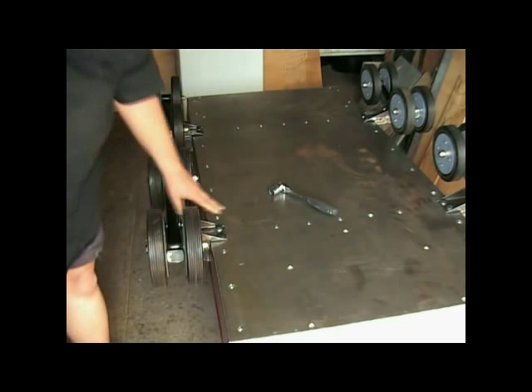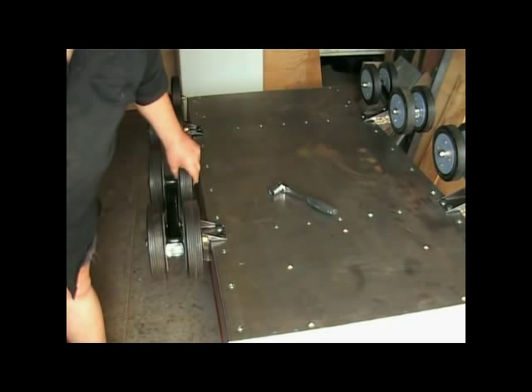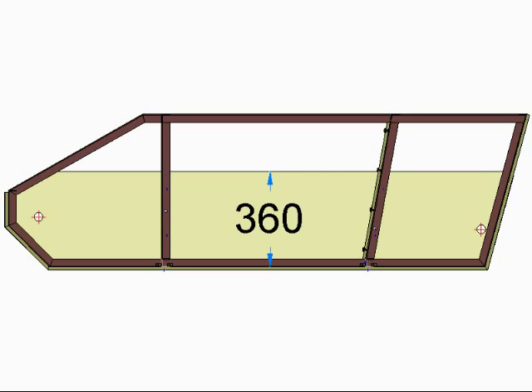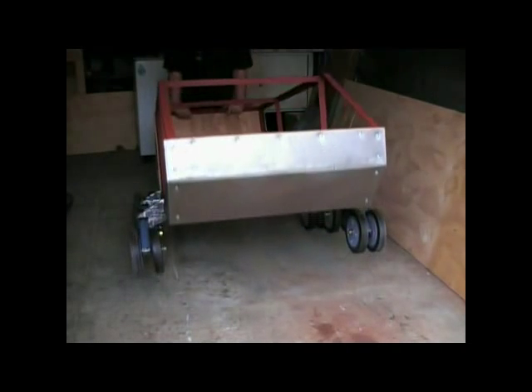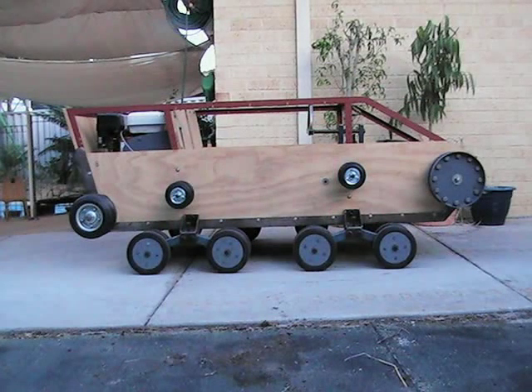The ride height and camber setting of the suspension bogies will be covered at a further stage. The side panels can now be cut down to 360 millimetres to allow for construction of sponsons over the tracks. This will provide greater storage space inside the hull and more clearance for the steering lever hand grips. Well there you have it fellas — you now have a basic hull ready to proceed to the next stage, that will cover the construction of the track return idlers and track drive cog.